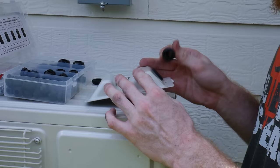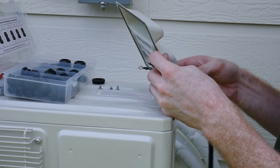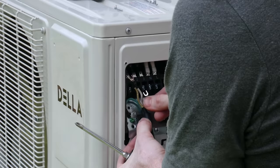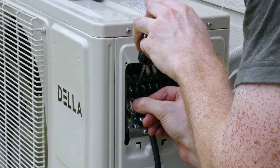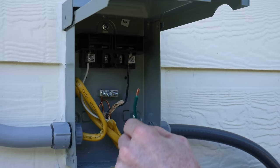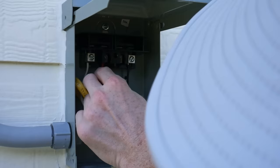Next we will be hooking up the electrical. I had a set of black weatherproof connectors from a previous heat treating oven build, and one was the perfect size for connecting the cables running from the inside unit to the condenser — you want a watertight connection here. Like the inside unit, the outside unit is very easy to wire up: the green ground wire goes to the green ground screw on the left, the yellow wire to port one, the white wire to port two, and the black wire to port three. On the power side I bought a 6-foot, 10 AWG pre-made whip, verified the 20 amp breaker was off, and then wired up the quick disconnect box. Note that the red wire on the whip will be used as a neutral. I used PVC adhesive on the flexible conduit and fittings to ensure a watertight fit.